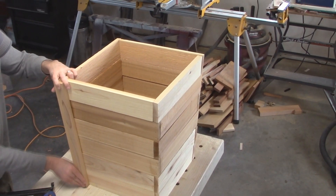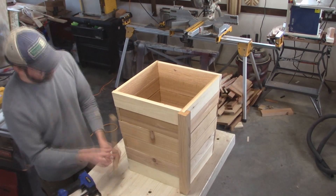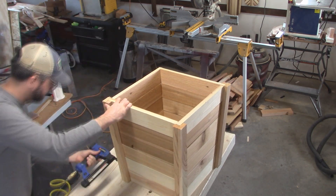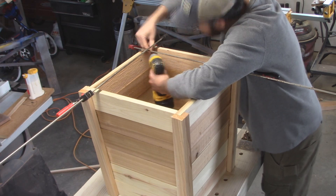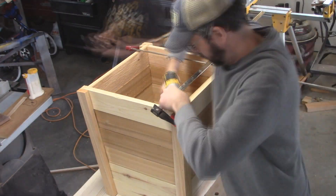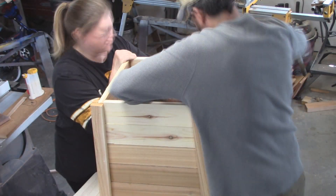When I attached these support rails, I didn't bother to use wood glue, I just did brad nails. Mainly because I didn't want a bunch of wood glue seeping out all over the sides, because the layers aren't exactly perfectly even. And I really didn't want to sand this project at all. Since I didn't do wood glue, to add a little extra stability, I took some wood screws and just screwed in from the inside into one of the rails on the top. Then we flip it over upside down and screw in another one in the bottom — just a little extra added stability.